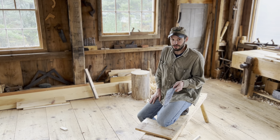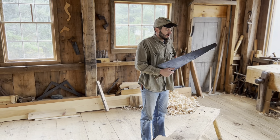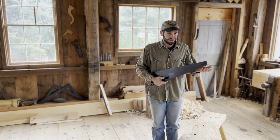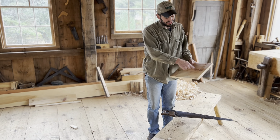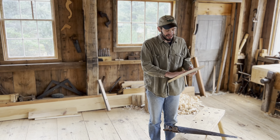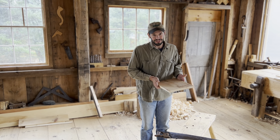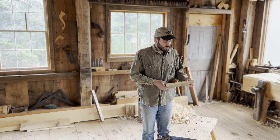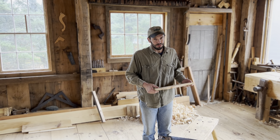So these two work in concert — the cross cut saw and the rip saw. You need both, really. Two different grain directions and two different tools. There's been this long-standing debate, as old as the hills: is a 45-degree angle across your board a rip or a cross cut? I'd welcome any input on that, but I'd suggest you go out and try it with both of your saws and see which is easier. I'm sure in different woods it'll be one or the other. The question of which saw you use for a 45-degree cut is one that no amount of debate will ever solve.